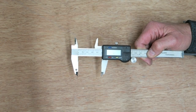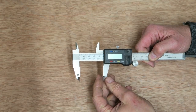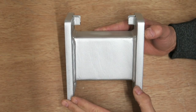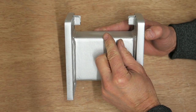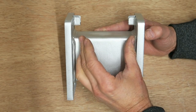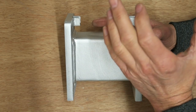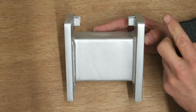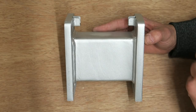So in summing up, in the first demonstration, the conclusion I came to was that you could heat the metal up, it would expand and contract to exactly the same position it was before, because there was no restriction. In the second demonstration, this piece of apparatus acted as an expansion block. As the metal was heated, it expanded until it had nowhere else to go, and then it took on extra thickness, because that is the only place the metal could go. Once the heat was removed, of course, it just shrank back down, leaving the bar shorter than it was before, which is exactly the same way it happens when you weld in a patch in a panel or weld two panels together.